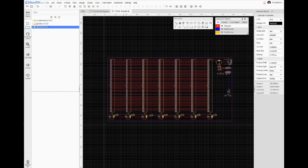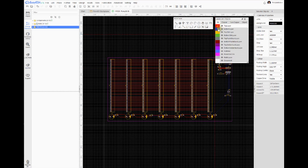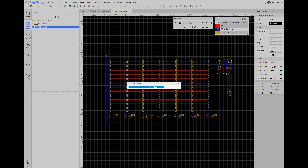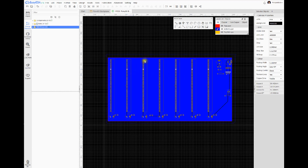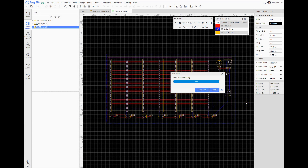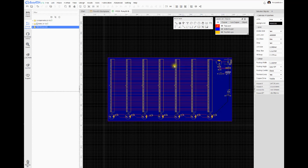What we're going to do now is put on a ground plane on the bottom layer, just as I spoke about in the last video. I'll click and drag to draw it. The ground plane was showing on the top, which it shouldn't be, so I'm going to unroute all and then auto-route again. Now it redraws the ground plane behind everything else, so what you can see is what's actually going to be on the board.